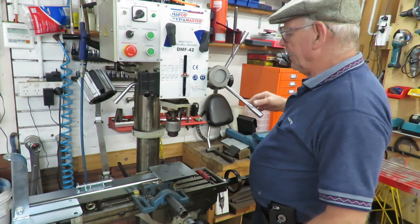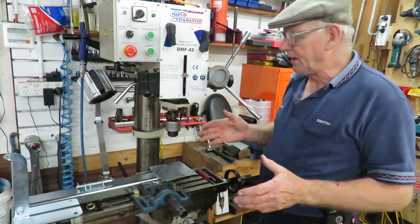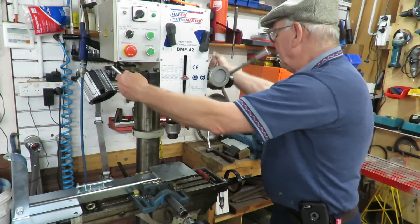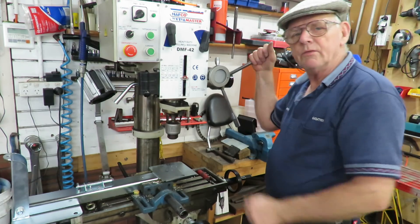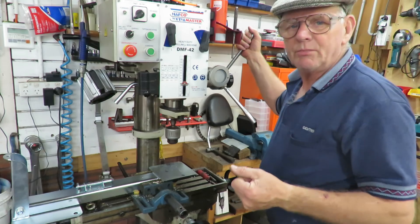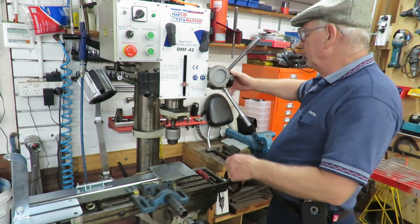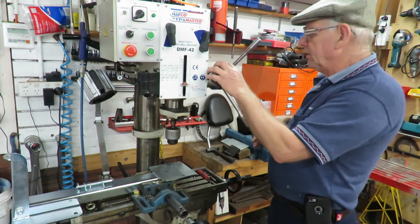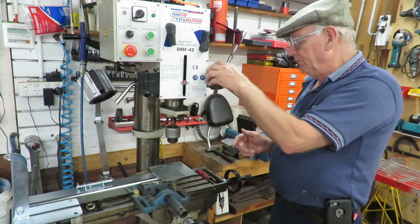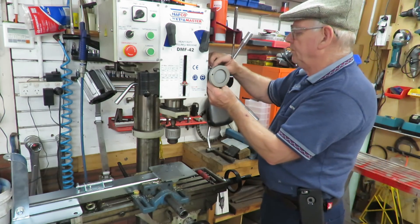The action of the quill handles is very well done. The handles are the right length, easy to use, and have a nice grip to them even though they're smooth — they're just made right. Someone with a larger hand might want something bigger. The locking is very simple: screw it in with its taper connection. You can use the fine handle for fine advancement — it doesn't have an auto drive but it has a vernier on it that you can zero in.